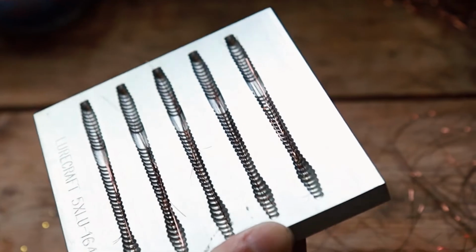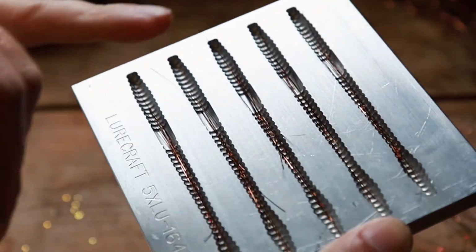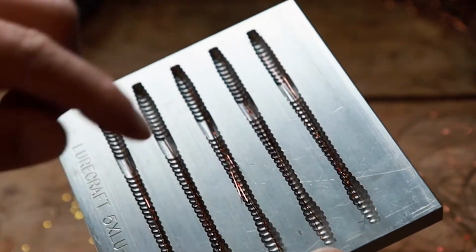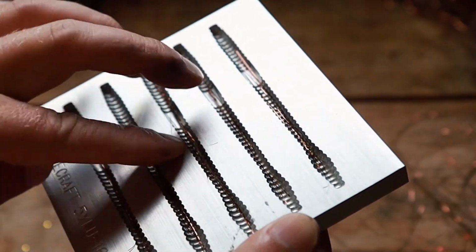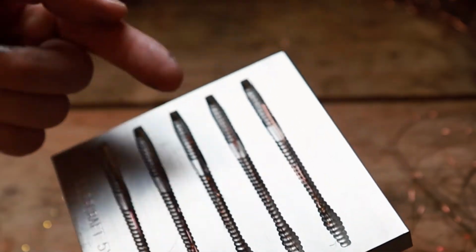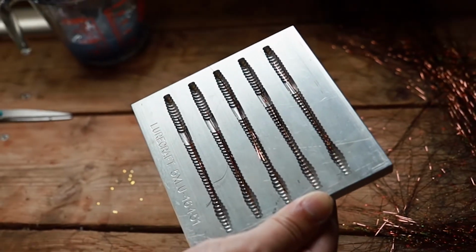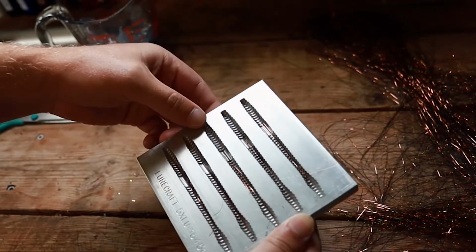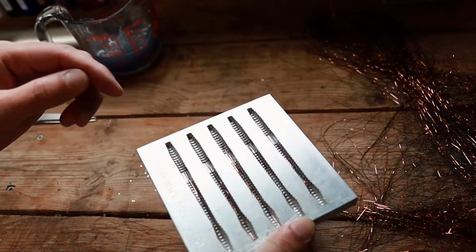So, this is kind of what it looks like. The tinsel's laying in there. I've tried putting it in the center and it didn't work out. I've tried at the bottom. I guess the easiest way to do this is to set it in there first. Whenever you do pour, some of the tinsel will come through the plastisol and pop up. I'll show you after this, but I've gone fishing with them that way and they work really good because it captures little air pockets and makes a little more vibration in the water whenever it protrudes outside of the plastisol.